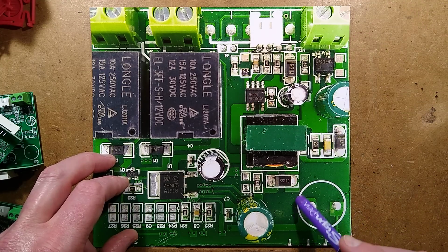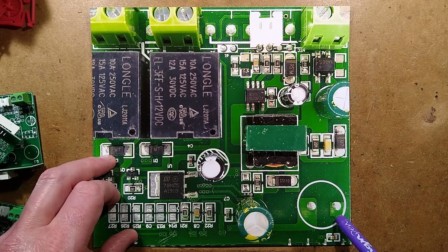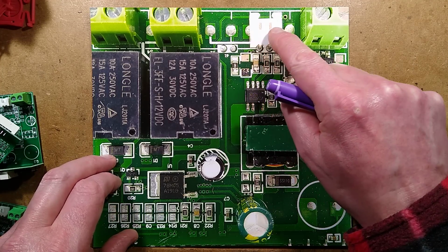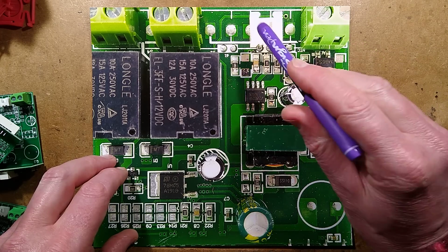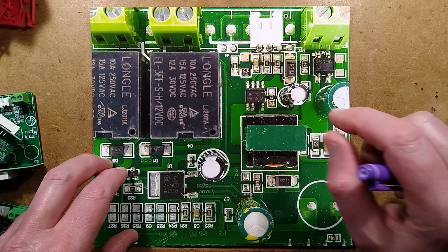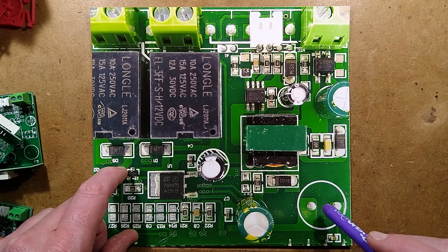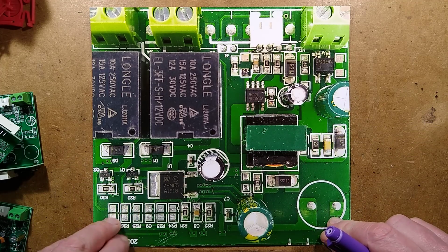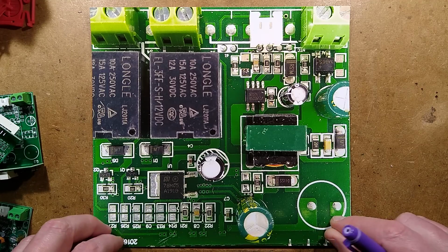I think this thing over here may have been a buzzer, because it does mention an alarm sounder. If you disconnect the probe, or if it's short-circuited or open-circuited, it will display error on the display. Double E, I think it is, and potentially it would sound an alarm, but the alarm would also sound if the temperature exceeded a ridiculous level. That's more or less it for the mains voltage one.